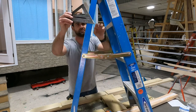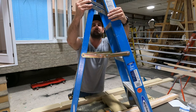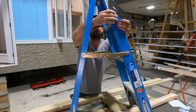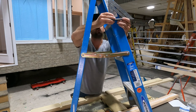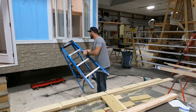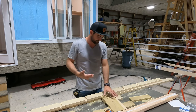You're not gonna be able to see it too good, but if I rack this up like this, these are at a 45. However, if I mimic the step like so, and I look up here, it comes out to about a 15 degree angle. It's a very comfortable step. But we don't have that kind of comfortable room. It's a tiny house, so we're going 5 degrees.